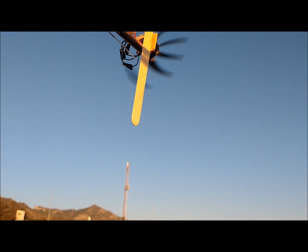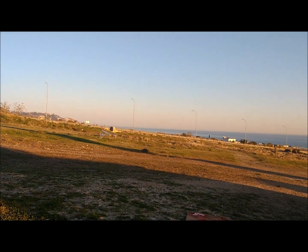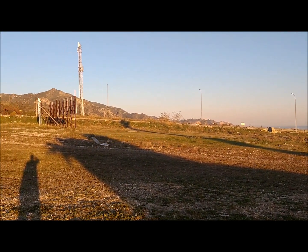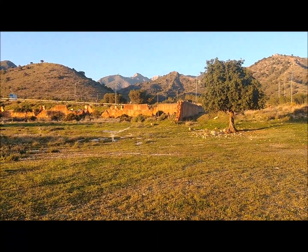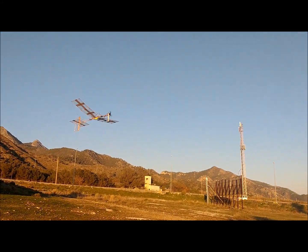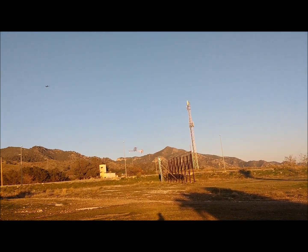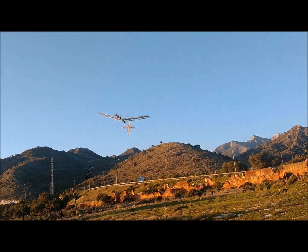To conclude, aerodynamic stability of the aircraft requires rigidity in its different elements. However, stiffness is only achieved by adding material, which also increases weight. In this design, we started with the minimum amount of material and then added reinforcements as needed, minimizing weight. Given the structural weakness of the plane, it can only be flown in zero wind conditions or indoors. If there is any breeze, the plane will become ungovernable due to deformation of the wings and fuselage.